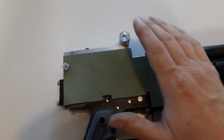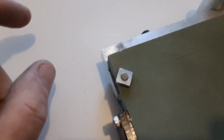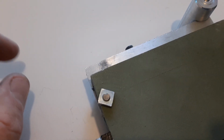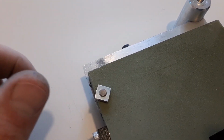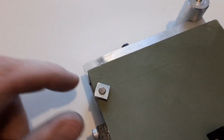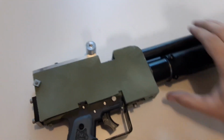The one thing I can say is that the top lever was an awesome idea. The mechanics at the back, as far as the pivot point and how everything interacts, was just so much easier than a side lever. Not to mention, you could pull the hammer and spring out while you had the lever installed, which would be impossible. Well, you could do the spring, but you definitely couldn't pull the hammer out with a conventional side lever installed. It just wouldn't work. With the top lever, you just have so much flexibility. So I really like that.